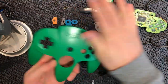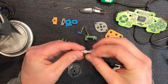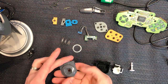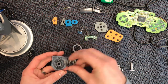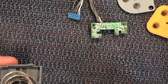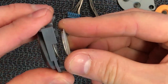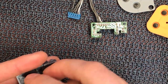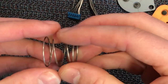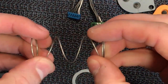We're back from the cleaning and it's all come up really well — nice and dry and clean, and the parts came up pretty well. Let's go ahead and reassemble. Start off with the top side — put the spring in and get the white plastic ring. There's a lip on the ring; the lip face is towards the spring, which secures it and stops it moving around. The very first thing you need to do is grab your spring and give it a bit of a pull and stretch it just a little bit, because over the years it's been compressed.